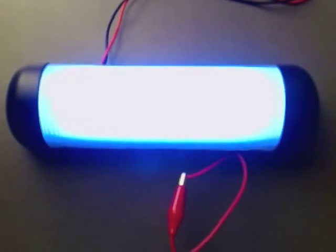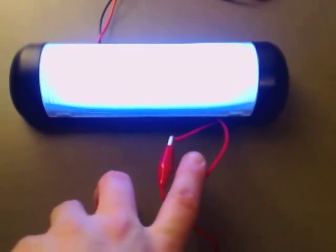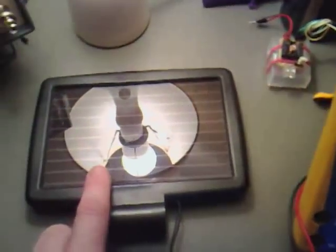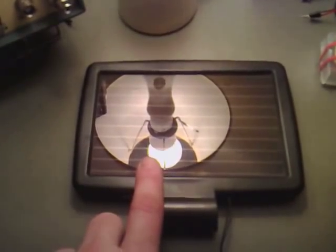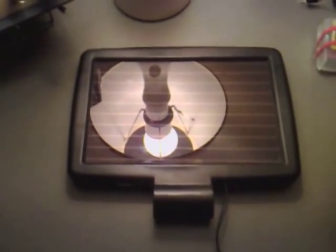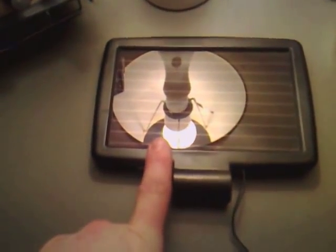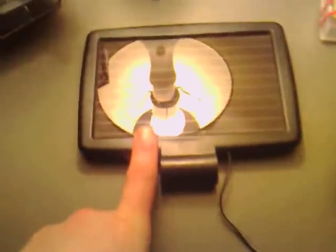You can see this is as it will be working. Obviously I've got to put the switch on but I want to leave it running. At the moment we've got 4.07 volts inside that solar cell because it's been charging up a 3.7 volt battery, which usually sits at about 4.1 volts when they're full. That's going to get kept on the windowsill. Because this battery is going to charge during the day, this one's going to dissipate during the day — and then when this isn't charging, it's going to charge this one up.